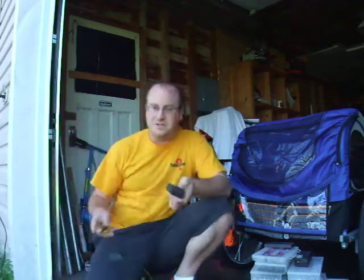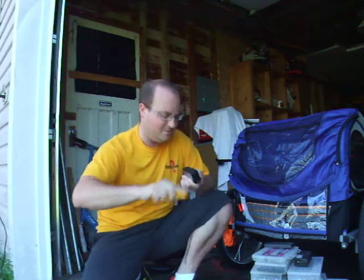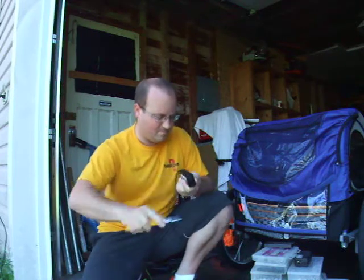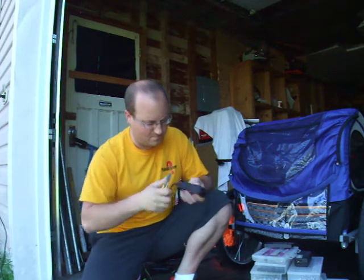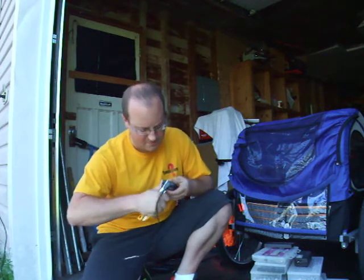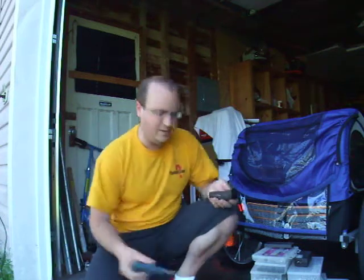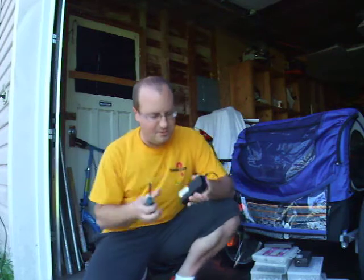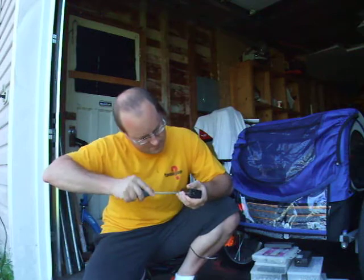Now the cutting disc leaves a pretty wide gap. You can just take a blade knife and clean the slag off the edge, like that. And now with a screwdriver, because now I have a gap, I can get in there and pop that open. That end with a little bit of convincing.